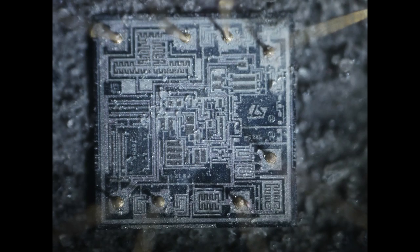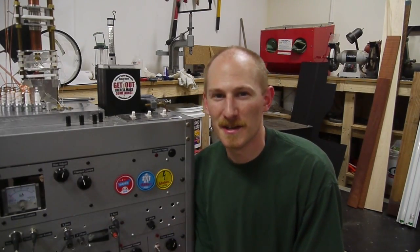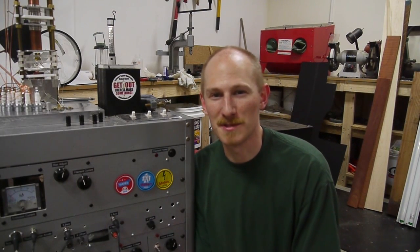I haven't done much debugging to figure out what's going on, but certainly the 555 is fried from the electron beam. I was keeping it down below about 3 kilovolts for the acceleration, but even at that it's probably enough to build up enough charge inside the chip to destroy it. For my next trick I'll try decapping the chip and then removing the oxide layer on top with hydrofluoric acid. This should prevent charge from building up in the insulation on top of the chip, and might explain why I was able to see charge changes in the electrical conductors near the chip but not in the IC itself — because there's an insulator over it, a clear oxide layer. I hope you enjoyed that — we have a long ways to go, but I think we'll pretty soon be able to decap a more complicated chip, run it in the SEM, and see what's going on in the die in real time. See you next time, bye.